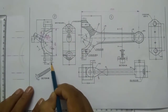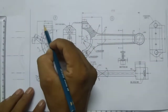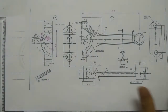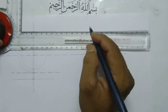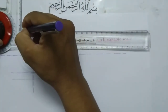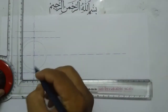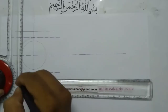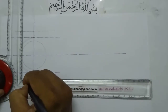Here this distance is given 3mm and this distance is 3mm. The total distance is 22mm and this to this distance is 20mm. So I am marking 22 here and 22 here, then marking 20 from here. 3mm from this to this point, and here also marking the point at 3mm distance.